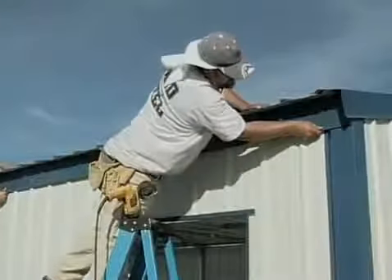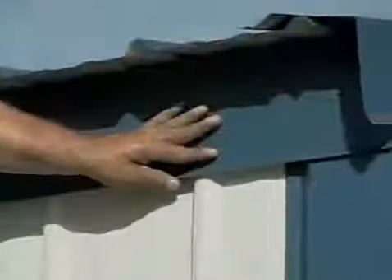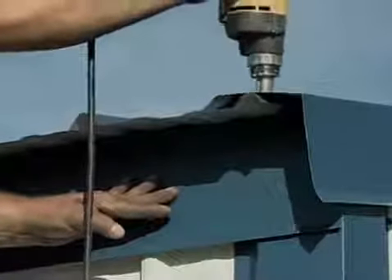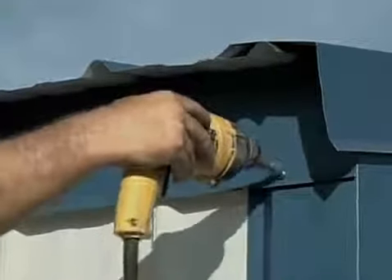None of your roof panels should have screws put in at the bottom. If you did put any in, they'll have to come out. So slip the eave trim under the edge of the roof panel and while holding it up against the underside edge of the roof panel and against the side panels, screw your color coordinated screw down through the roof panel and into the first purlin.